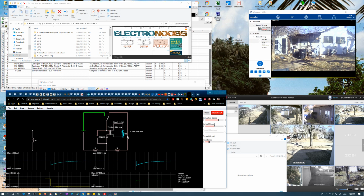So, yeah, the secondary does trade. If this is at half an amp on the charging end, and you switch it over, it'll try to maintain a half an amp through your secondary load. Now, what I was wanting to know is if I change this ratio to where you've got a 10 to 1 ratio here, what will happen? Because we already know this is generating like 50 volts, right? So that was kind of the big question I had.